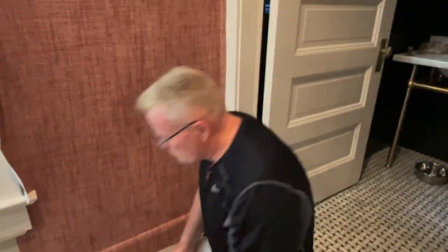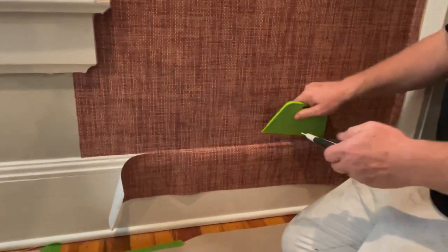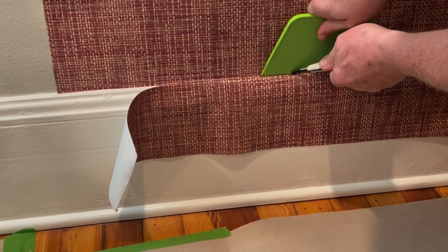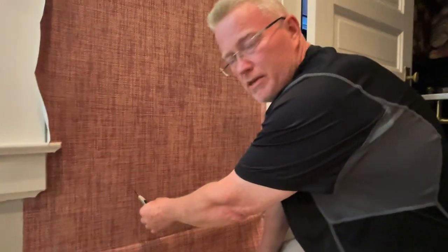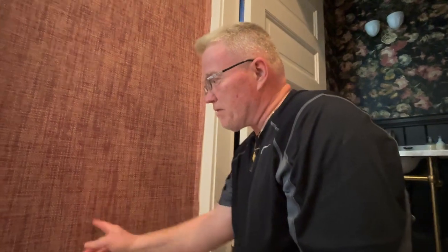But there's a trick. You do not want to cut it like this. You want to hold it down. You move the blade, not them together. Because if you move them together, especially if you're doing a straight cut, you're going to pull one of the threads, and before you can stop, it's going to go up 12 inches. So when you're cutting grass cloth or some other natural product that has threads going through it — these are cross threads, you've got them both ways.